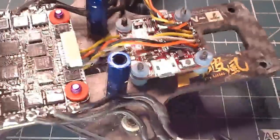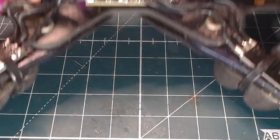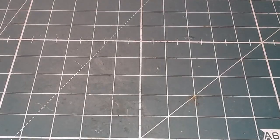All right. Check our work. I think we're good. Yeah, good enough. Whoop, nope, not good enough. Two of these guys tried to bridge themselves. When did that happen? That might have been a little solder ball. That's why you check your work, ladies and gentlemen. Probably wouldn't have blown this up, but the video wouldn't have worked. That's better.